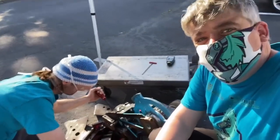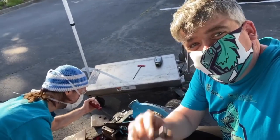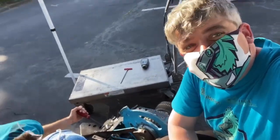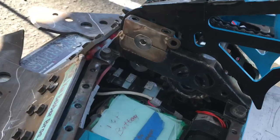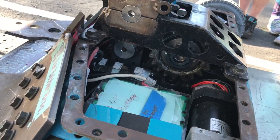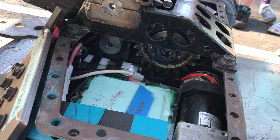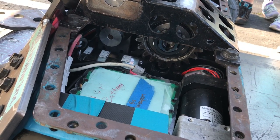Hey Mark, we're working on Scorpios today and we're still finding chunks of Ice Wave inside of it — let me know if you need this back. All right, it's time for our first test. We've loaded the batteries into the robot. The idea is the gear should stop but the gearbox should continue on. And it looks like it works — the gearbox is continuing to rotate and the clutch is clutching.